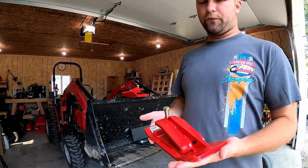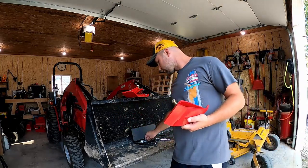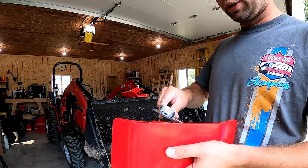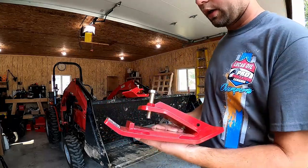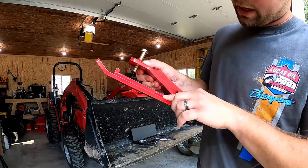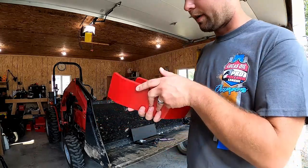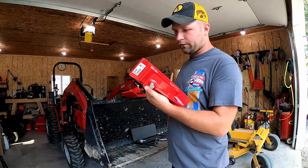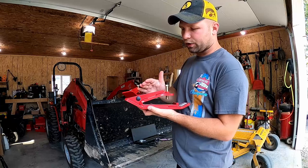Let's take a look at how they're built. They are very heavy-duty, made here in the USA. Let me pull my calipers out and get specific — they are exactly 0.375 inches, so three-eighths of an inch thick steel. They have really high quality welds and they did a good job of cleaning up all the splatter — I don't see any splatter on the welds. These things really are a gem in my opinion. Obviously they're gonna get beat up because they're gonna be dragged on the ground and smacked into things, but for first initial impression I give them two thumbs up on quality.